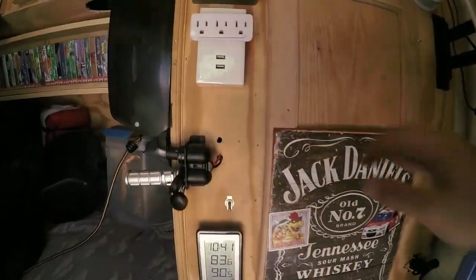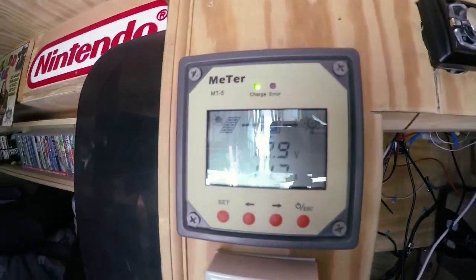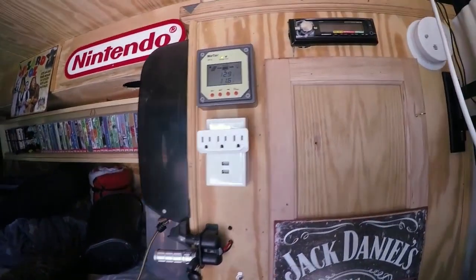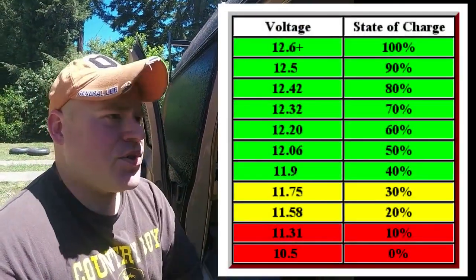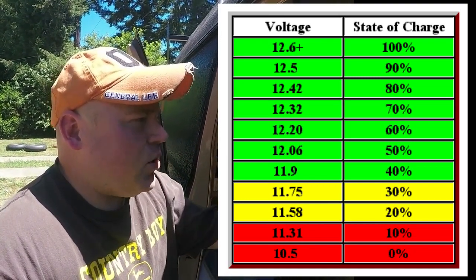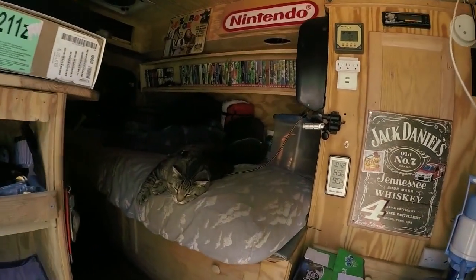Basically, there's a lot of math involved in calculating how long your air conditioner will run. My inverter inside has kicked on — you can hear it humming. The fans are on because it's drawing power. Volts after about two minutes of running are at 12.9, with 12.1 amps coming in. So we are drawing power, but we have not dropped too low. I talked in a previous video about how to understand voltage relative to battery levels — I'll flash that on screen so you can know what 12.9, 12.7, 12.2 means as far as percentage of your batteries. When this inverter can no longer maintain the voltage the air conditioner requires, it will start beeping at you and tell you it can't operate the air conditioner anymore. And like I said in previous tests, that's been about three to three and a half hours in the sun.